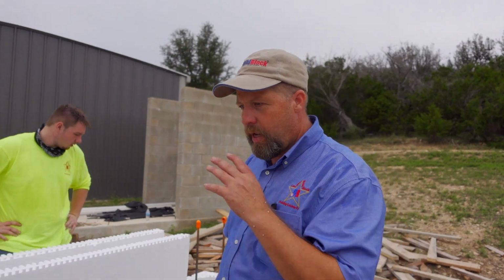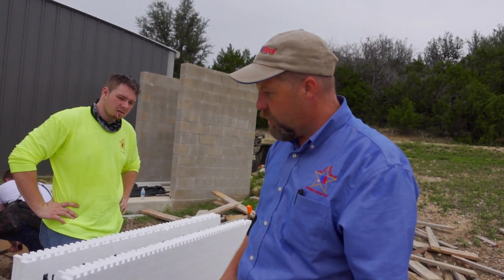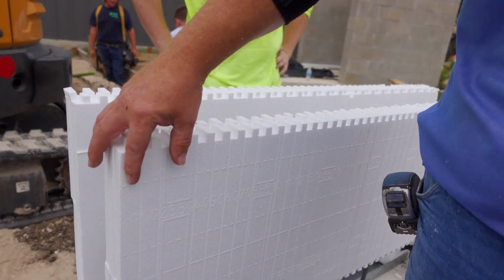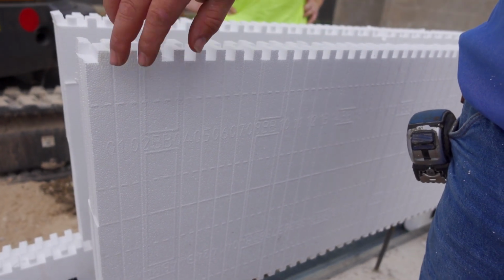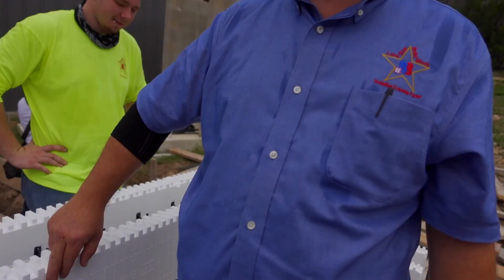All right. Just pay attention, and I'll tell you the other little trick. Okay, another trick, and you'll see this on the Build Block Training website. They'll show you this. Some old school guys don't like it, but I found it to be helpful for guys that don't know how to read a tape. We have tabs, meaning these denote 1 inch. Okay, this is 2 inches, but it's a web. So I have tabs, webs, tabs, and I use a 3-number system.